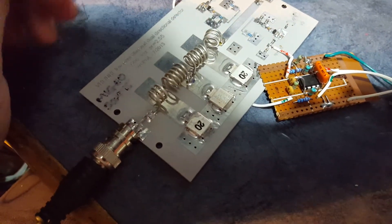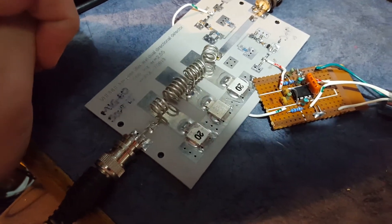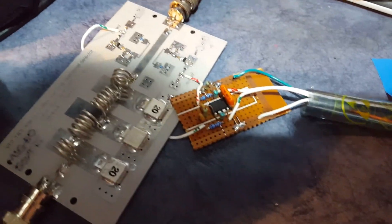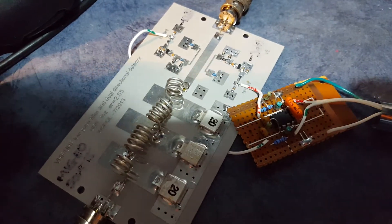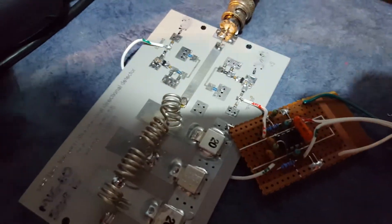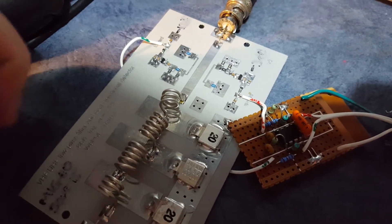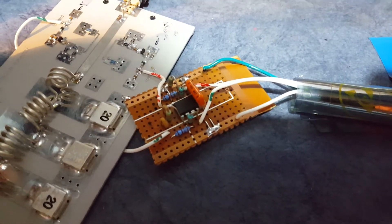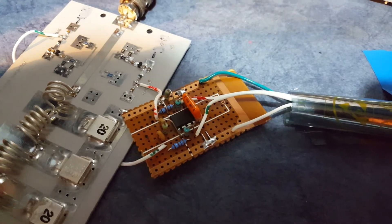A bit of strip line goes out towards the antenna on the back. Using an ICOM 7100 and solid-state amplifier to test — it's putting out about 100 watts. The directional coupler is supplied by W6PQL. It makes a negative voltage, so these voltages are negative with reference to the ground points. The op-amp takes those and has a gain of minus 10, so it inverts the voltage, making it positive and multiplying it by 10.